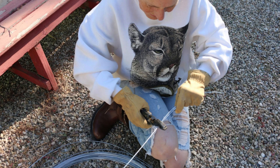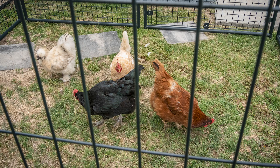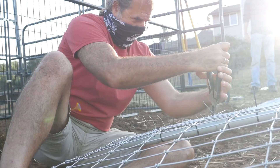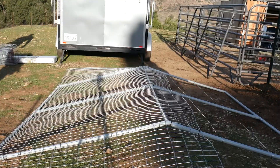Exclude climbing predators like cougars with 11-gauge or thicker chain link fencing. The diamond design of chain link is much more difficult for predators to climb than vertically aligned fencing. Cougars can fit through very small spaces — gaps greater than four inches are possible entry points and also allow enclosed animals to poke their heads outside. Wrap metal wire every four inches to secure fencing to the enclosure's main infrastructure, binding structural elements strongly so there are no breaking points or large holes.